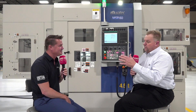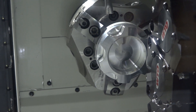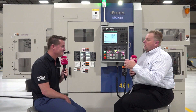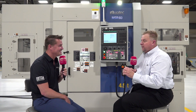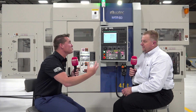You just nailed it. In a perfect world, we want the spindles to be of equal time, and there are great application engineers that can get close — but sometimes there is just a mass imbalance. What a single spindle allows me to do is to drop the guarding on one side and bring it beside a twin spindle. I can use my two spindles on Op 10, the longer cycle time, to divide that out, feeding one Op 20 — which now allows my throughput to go up without having to buy two machines. The capital investment is much better. We've been doing this for 30 years. I've personally been in a lot of shops where a part is just sitting, waiting for operation two because operation one is taking too long, and operation two has already finished.